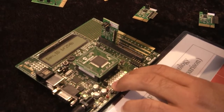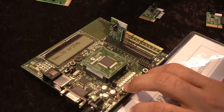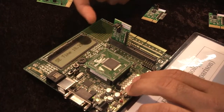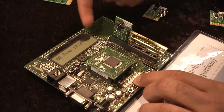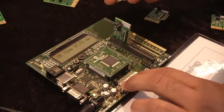What we're highlighting here is the screen showing you the device ID and the sector erase time — in this case 18.29 milliseconds. It also shows us the block erase time, which is the same in this case, and the chip erase time.